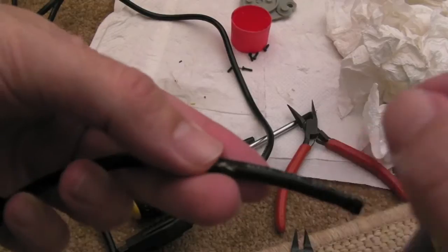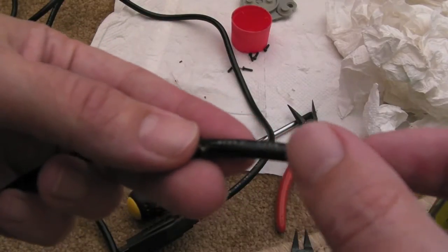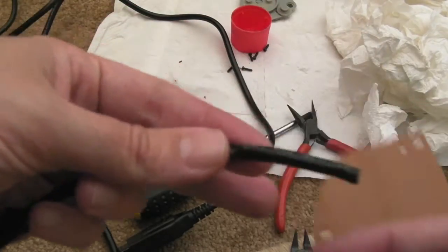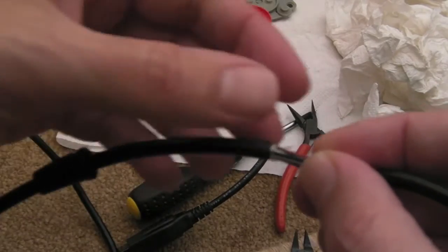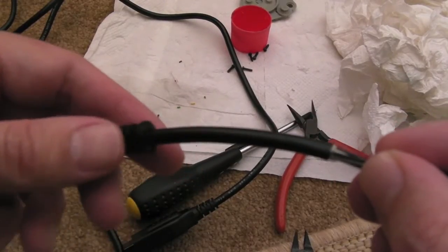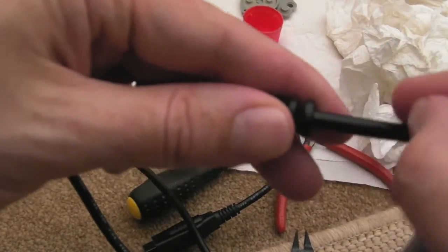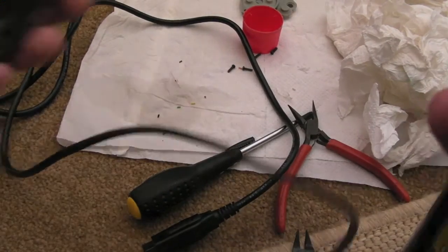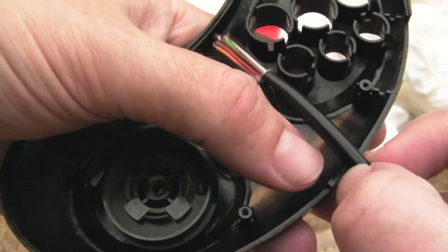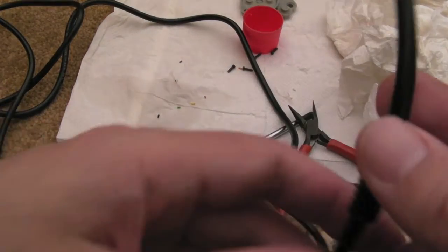Getting back to what I was saying — the grommet was in a bit of an awkward position. The other thing you can do, if you'd managed to solder that connector, is to slide a piece of heat shrink tubing over the wire, pull the grommet all the way back, and put the heat shrink tubing over the join. But then you get a problem with the grommet — you could cut the grommet off and just not have one. The other way to get around not having a grommet is to literally tie a knot in the cable and pull it tight — you'll have a large bulge there within the controller housing that'll stop it from coming out. You could also use a smaller grommet, fit one yourself, and then the heat shrink tubing would be covering the bit of damaged wire. There are a few different ways to approach this.